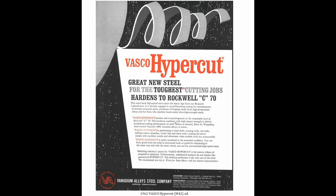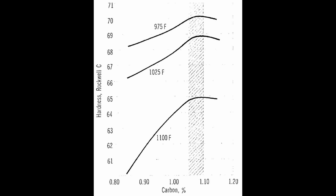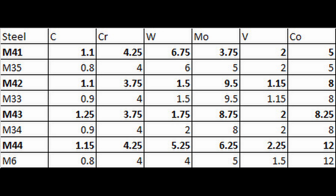In the 1960s, a bunch of steel companies started developing high-speed steels that could be heat-treated to 70 Rockwell C. The most common of these was by Vasco called HyperCut, patented in 1963, and it was given the designation M42. What they realized is that if they used large cobalt additions, like 5 or even as high as 12%, in combination with increased carbon, they could get high hardness. Part of this was technology — they couldn't control the carbon tightly enough before then, but technology had improved to the point where they could really max out the carbon content without adding too much, and then get these 70 Rockwell C steels.